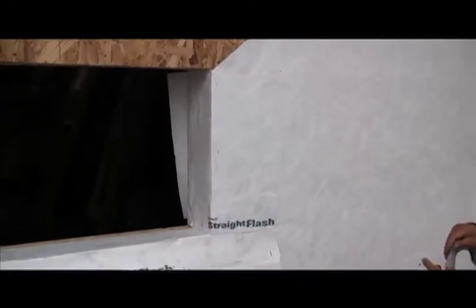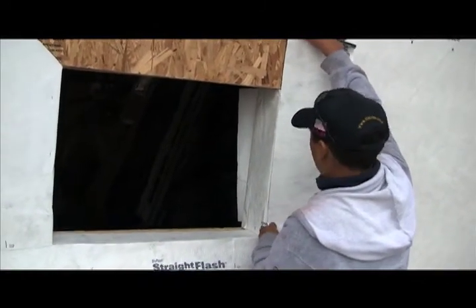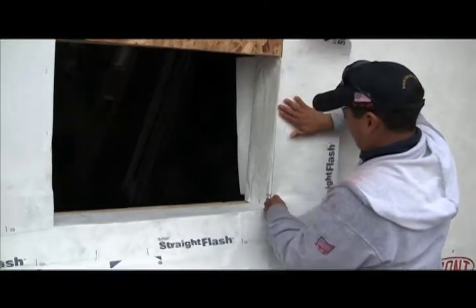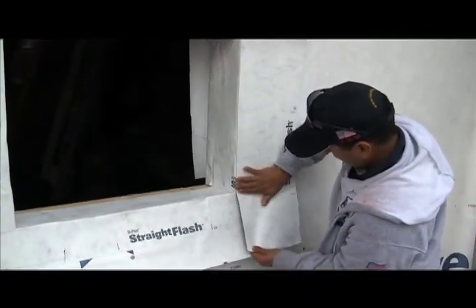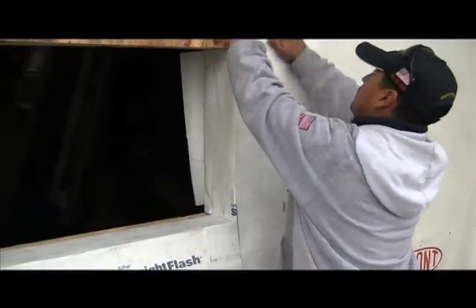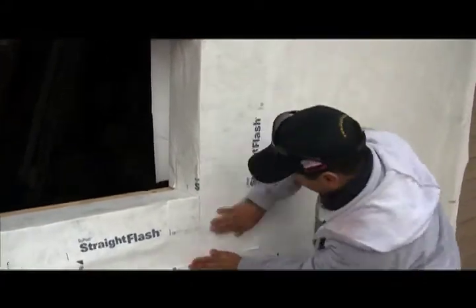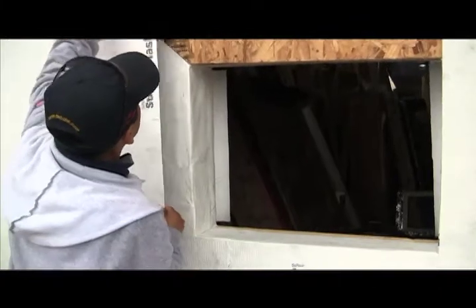The main difference between the B1 installation and the A1 installation is that with the B1, the side flashing goes on first so that the window nail fin will go on top of the side flashing. In our testing we've discovered that a B1 install will perform better than an A1 install. Others may disagree and that's fine — an A1 install can be just great, and we'll show you how to do that at a future date. For now, we're going to do a B1 install.